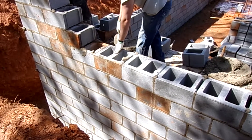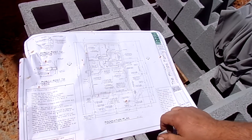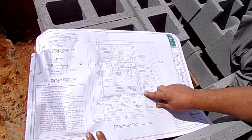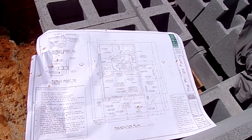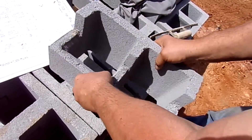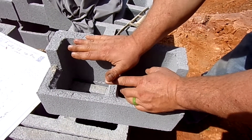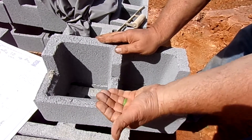Once the line is up, you don't have to spend a whole lot of time leveling — you just work it to the line and go with that. The back wall and left side wall are going to be twelve-inch CMU walls. The right wall will be an eight-inch CMU. And the front wall, the daylight wall, will be a two-by-six wall that uses what we call a header block. The header block goes in, and then we pour concrete right up to that point. When the two-by-six goes on, it covers the joint, so all you see is the concrete — this makes a nice, clean look.